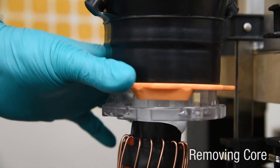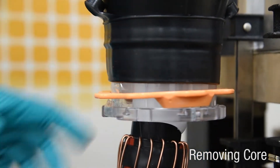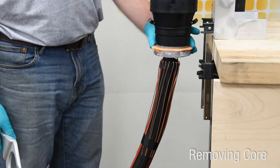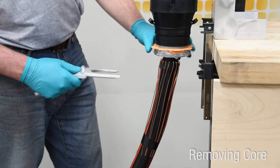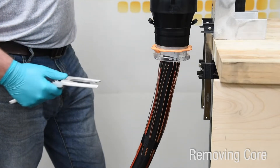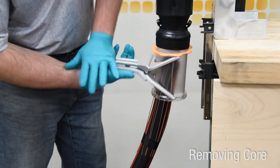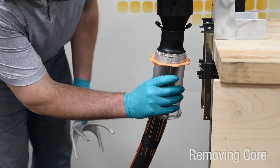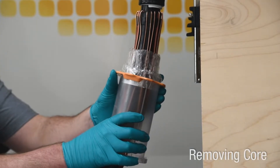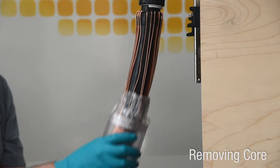Grasp the removal ring and push it against the core flange. Twist so that the cutting teeth break the tape on both sides. The core may be removed by hand. A core removal tool is useful in installations where space is limited. Insert one half of the core removal tool and pry slightly to make room for the second half, then insert the second half and bring the handles together to eject the core from the housing. Completely remove the core from the rubber housing by hand — do not twist the core while removing. Separate the core into two halves and clip any remaining plastic rings on the cable. Dispose of or recycle the core.